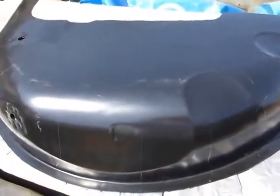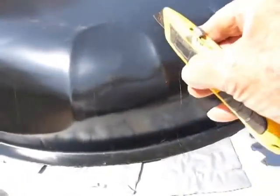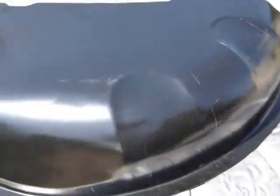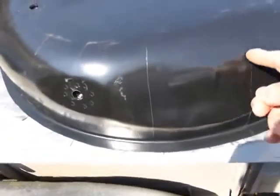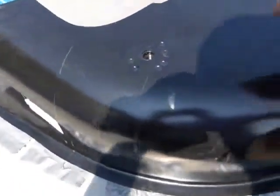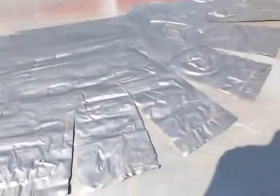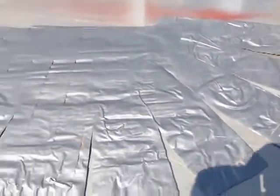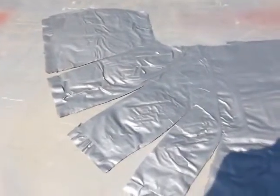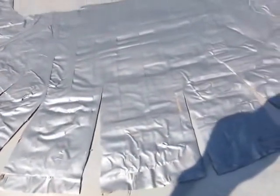This is the next stage — you can see the marks and scratches there where I've used the Stanley knife to cut through this template all the way around. I've done it where there's a fairly flat area where there's a bulge and spaced them out. The result, as you can see here, is that it's laid out flat. I put some steel over the top and flattened it right the way out. Hopefully now I can reverse this and give it a try.